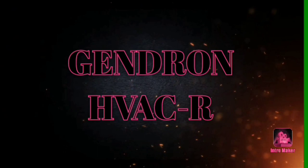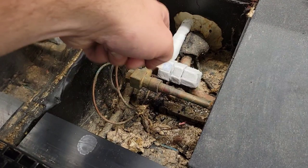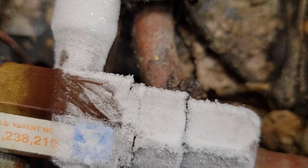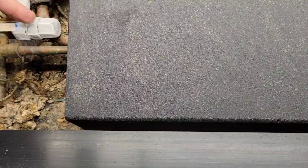Today we're going to replace the core and power head on this TXV. First and foremost, you got to see what kind of TXV it is. So if I scrape off this ice right here - probably impossible to see on camera - but there's actually an SBQ marking on it. You can see the BQ: that's a balanced port Q body. So we know it's a balanced port body, and that's going to be significant to the core that we have.